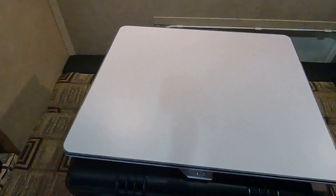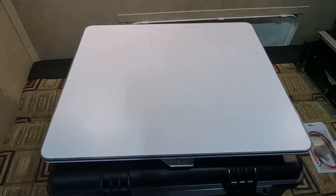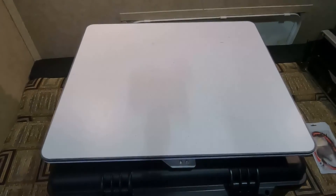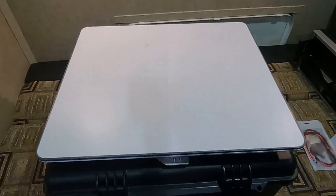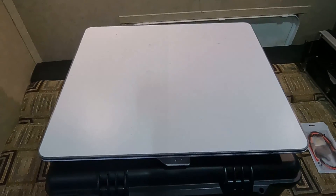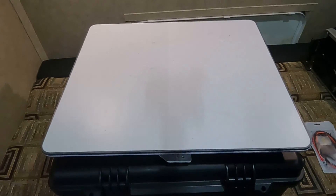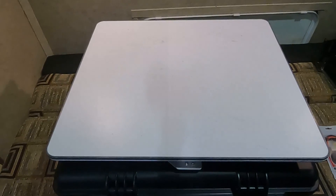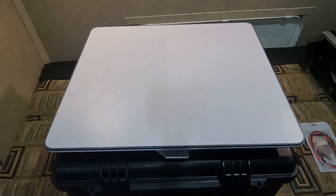That's basically the setup. It lays flat and doesn't need to point because it's designed with a phased array antenna system. It's much bigger — you can see how much larger the surface area is. It's significantly more than the articulated gen-two and more than the new standard Starlinks. Alignment isn't as critical; it does tweak for best bandwidth, but these get easily over 200 Mbps laying flat if you have a nice open area.